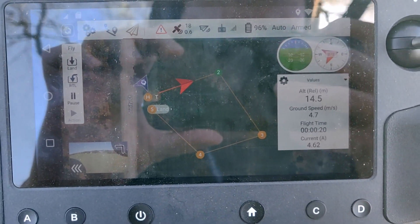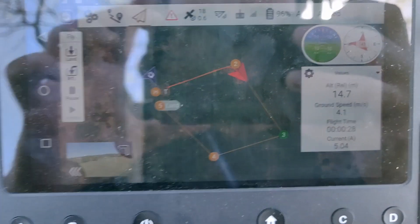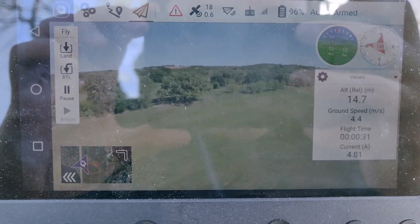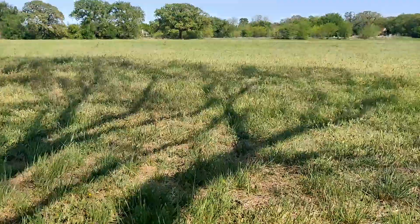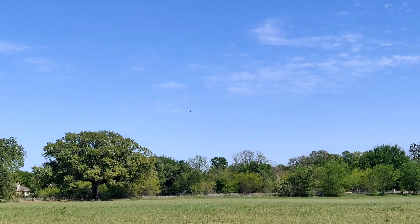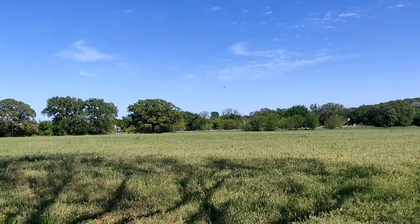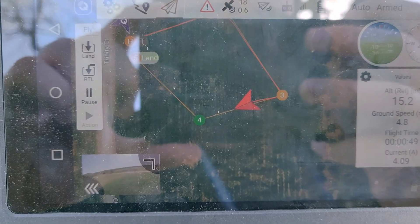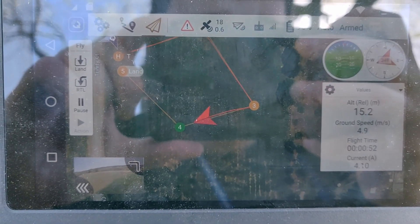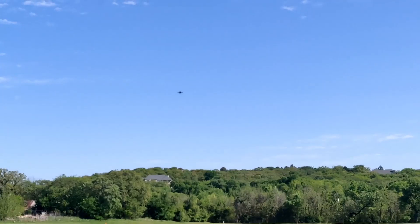Next I borrowed my friend's GoPro and connected it to the HereLink, streaming the FPV video in real time over the HereLink digital FPV link to the HereLink ground unit. I played with the settings because the GoPro Hero 7 has HyperSmooth technology which makes shots look a lot better, but when streaming that adds a lot of lag — so it wasn't great for flying FPV. Turning off HyperSmooth was better for flying FPV but resulted in much less stable shots.